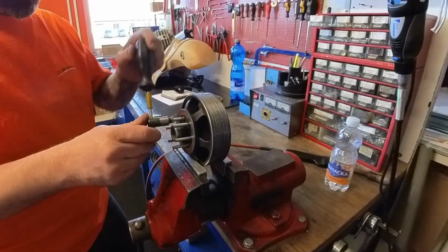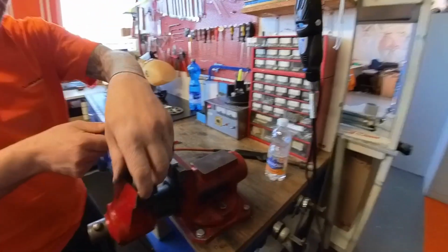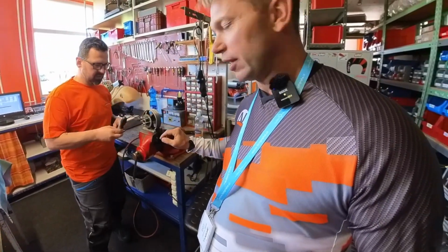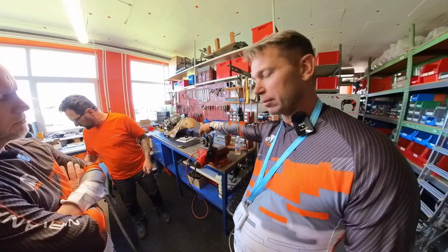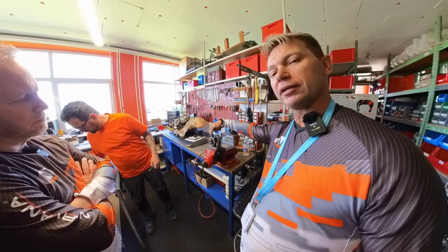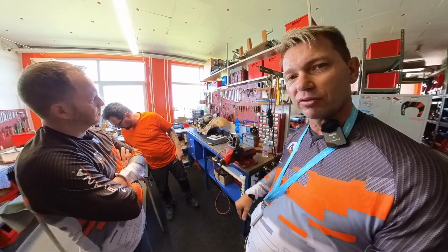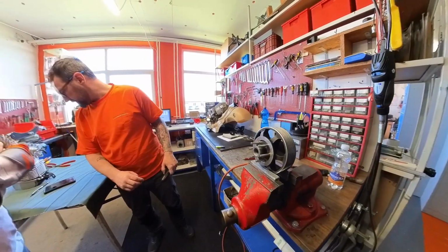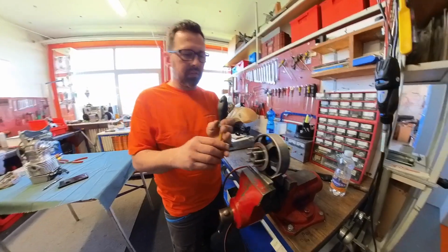He's saying he's not going to heat the pin, but the metal around it. Just to highlight that, he wasn't applying the flame onto the pin, but to the base of the pin, on the well and behind it. Applying the flame behind it means the heat translates all the way through and loosens up the glue.